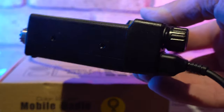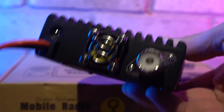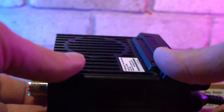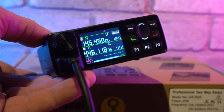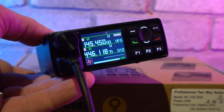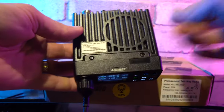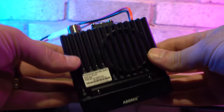On the back of the unit there isn't much in the way of connectivity — just a fixed power cable and fuse unit and a 2 pin quick disconnect socket. The only other port is a 3.5mm jack socket that doesn't appear to be for an external speaker. There is a small fan at the rear to keep things cool on high power. The entire body is made from heavy duty metal and, in common with similar radios like the Anytone AT778, it forms a heatsink.